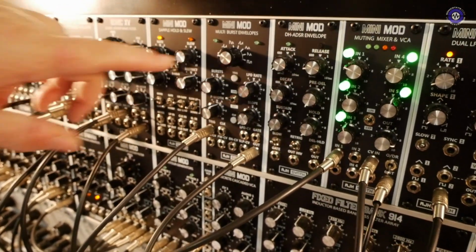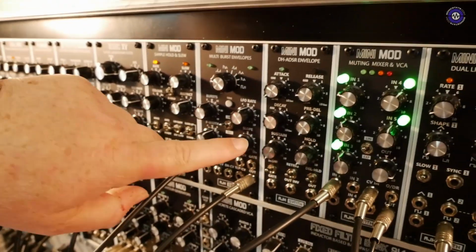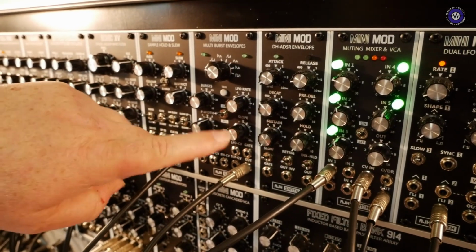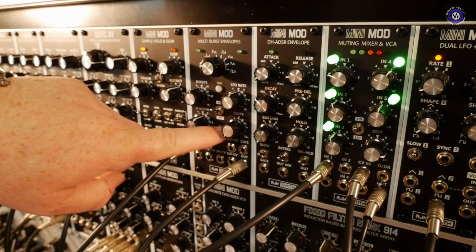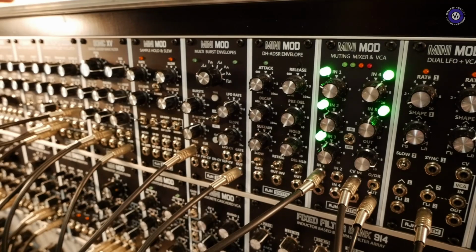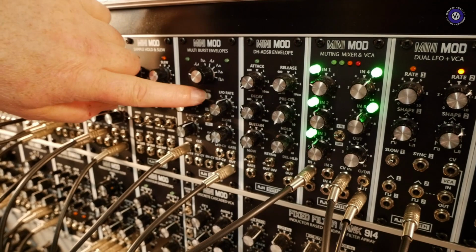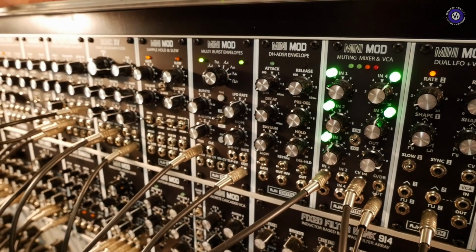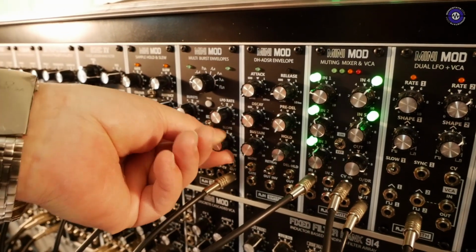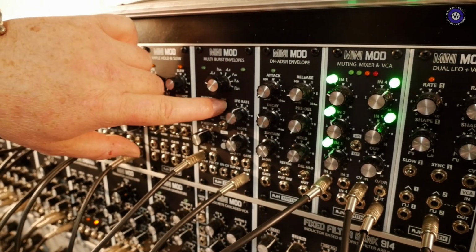So that's a burst sequence of 10 bursts. Now with that, we've got the burst control fully counterclockwise, and the slope control fully counterclockwise. So in that case, the first burst in the sequence is only 4% of the level, and it works through until the last one in the sequence is 100% of level. So they'll increase in level as the sequence progresses. If we put the control central at 12 o'clock, then all of the bursts will be the same amplitude.